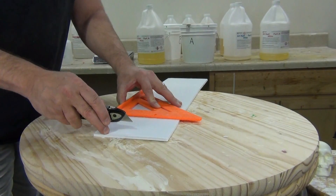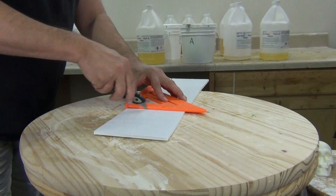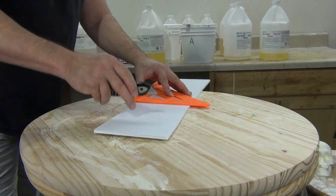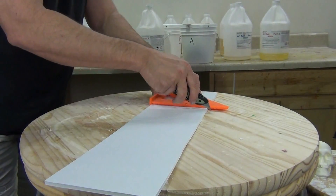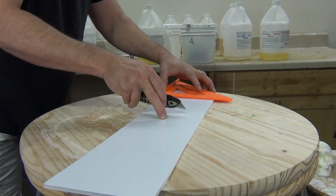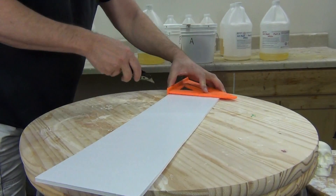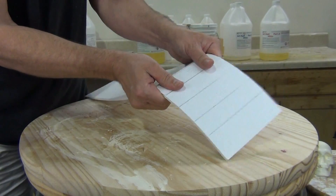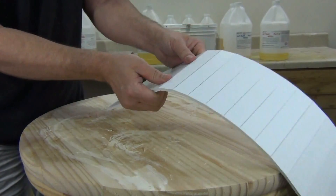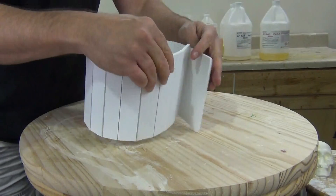Now I'm making a traditional foam core box. This is a great way to make a mold box for a small object like this. Foam core board you can find at most office supply places, and for small molds this is ideal because it's much easier to cut than MDF or plywood or anything like that — very easy and very quick to make a small mold box. If you've followed our channel for a while, you've probably already seen this used to great success for a lot of different size molds. I cut this off a bigger piece, so one edge is going to be nice and straight, and that's the edge I'm putting facing down.